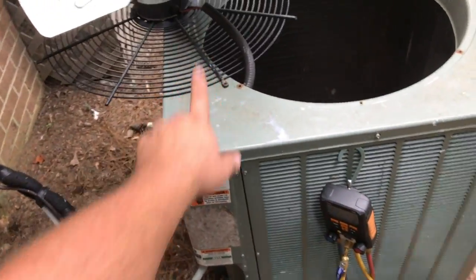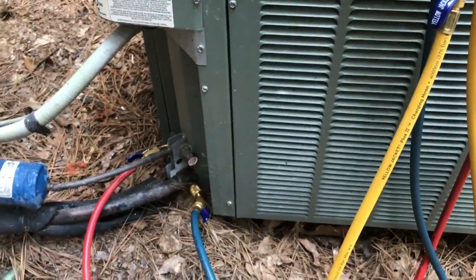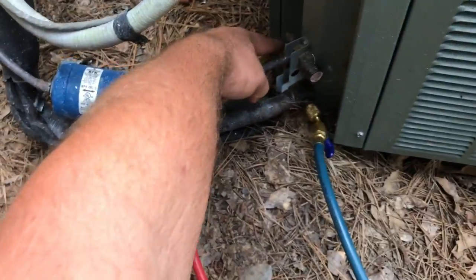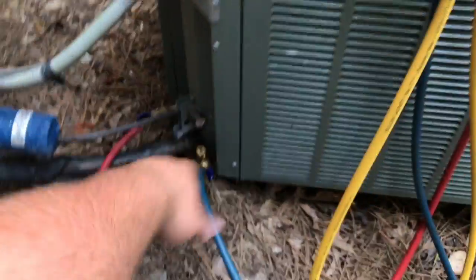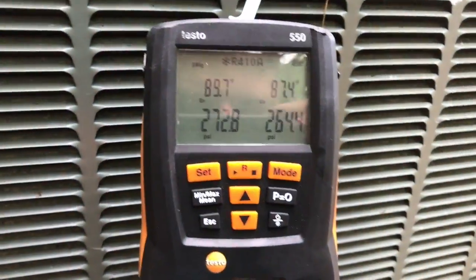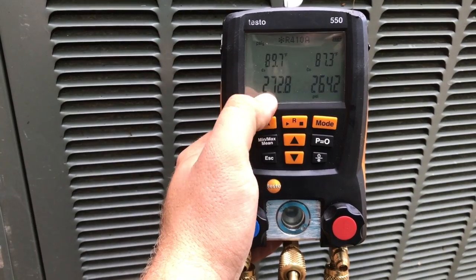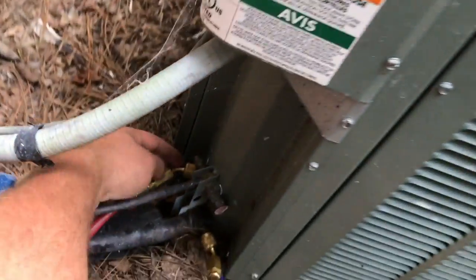I didn't take the grill off when I had the leak detector in it, so I recovered that small charge back out and put nitrogen in there. Then I used a method I've seen Ralph from TNN Services use - you can close these valves here. On a heat pump you've got the charging port which goes just to the outdoor unit, and then you can put one port on the line set and coil. I've got my blue hose on the line set and the coil and my red hose on the outdoor unit. We started out at 272.4, this has actually climbed four tenths up to 272.8, and this you can see has dropped to 264 - the red hose going to the heat pump charging port in the outdoor unit. So I knew my leak was in the outdoor unit.